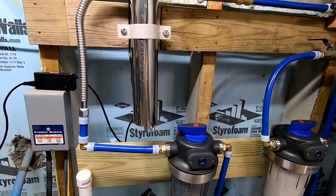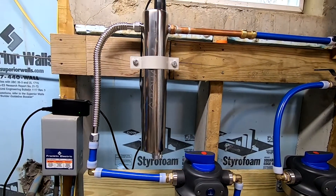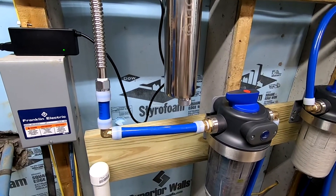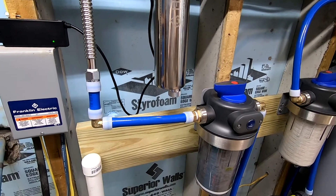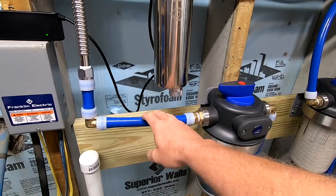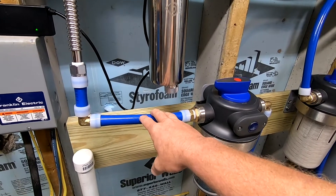The main thing to note though, is that when you're connecting your piping to the UV water filter, any type of plastic pipe is susceptible to UV damage. Do a quick internet search for yourself and type in 'UV exposure to PEX piping.' PEX pipe cannot be used outdoors due to UV exposure.